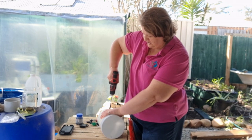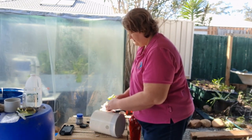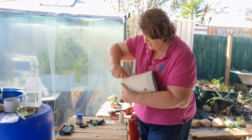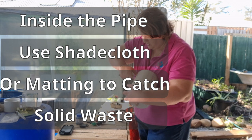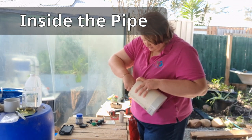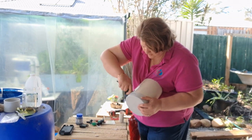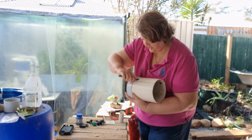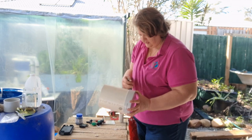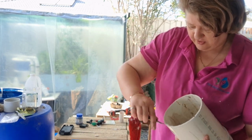I do want a valve in the fish tank to adjust the pump. Now trimming off these edges — don't cut yourself. You can use a deburring tool; I'm actually using a knife. Do it on both sides, making sure there are no sharp edges anywhere. Try not to enlarge the hole any larger than necessary because it was a perfect fit before. I should also file off the end of the pipe where I was cutting.